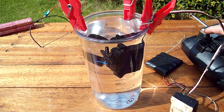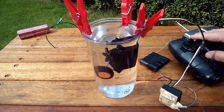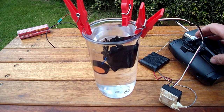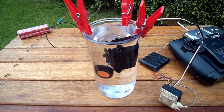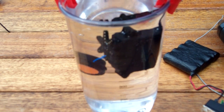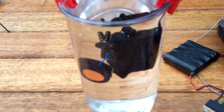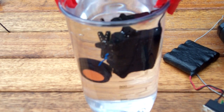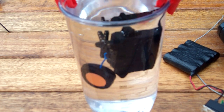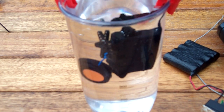It's all submersive. You can see the servo. The servo was dismantled. Silicone grease was applied round the horn, inside the plastic cover, on the top plate. It was reassembled and put back.